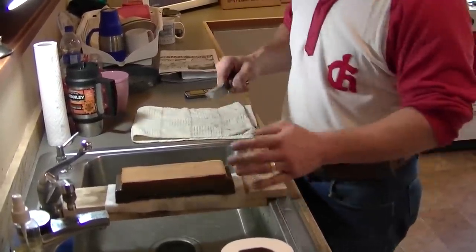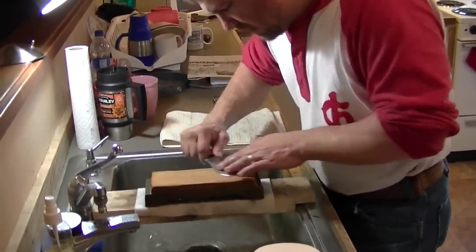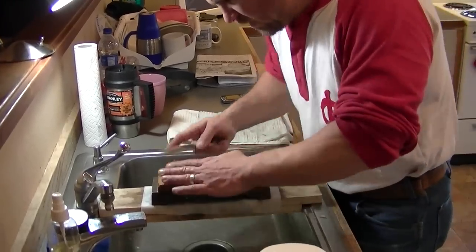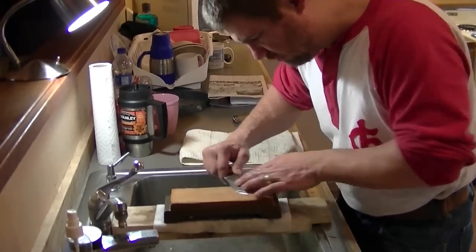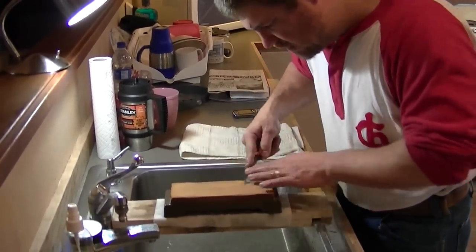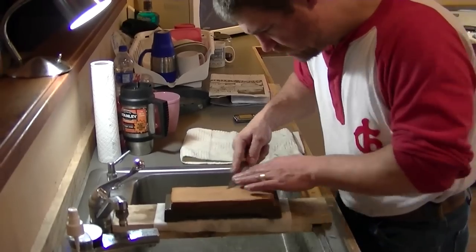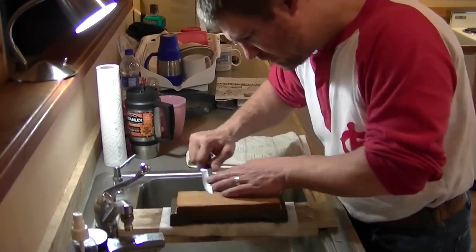I'm going to draw the edge through a piece of wood two or three times to knock off any burr. Normally I only do that once, but when we're trying to prepare the best edge possible — one that might rank nine and a half or ten out of ten on my sharpening system — we pay more attention and might knock the burr off twice or even three times, whereas for a normal working edge we'd do it once. I'm going to lighten the pressure as I feel I'm getting closer to finishing, to really burnish that edge.